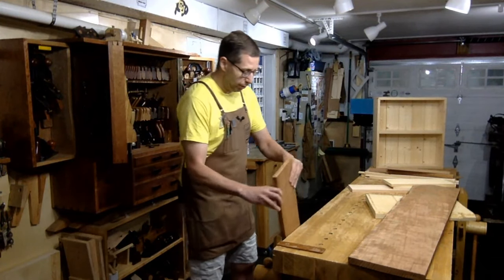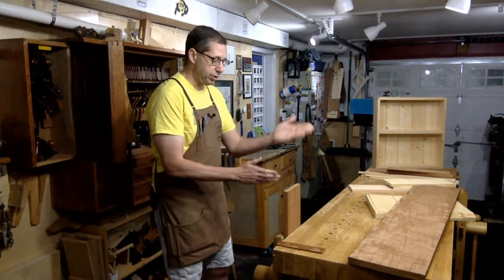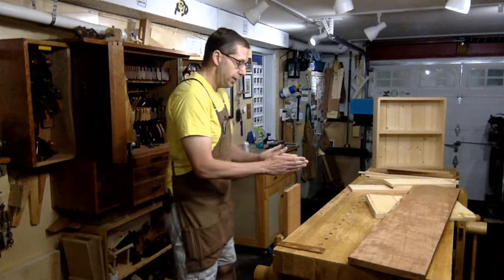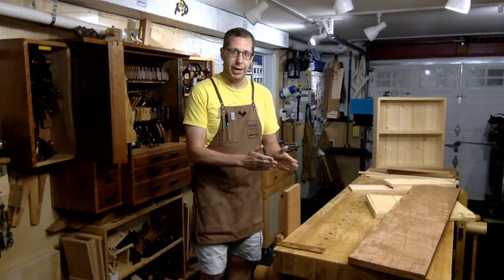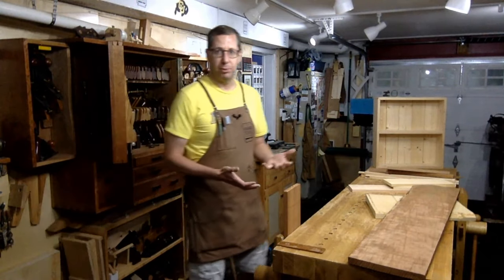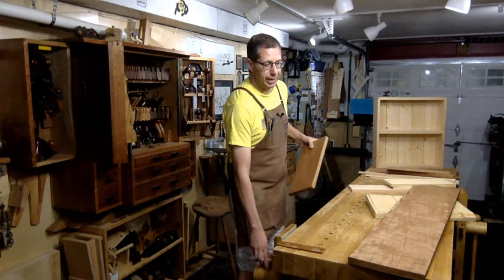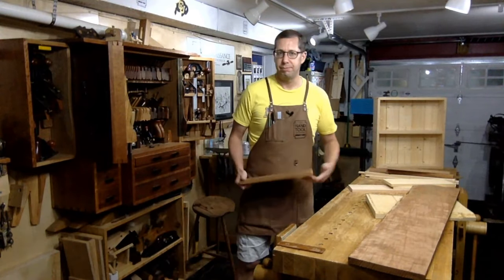And as we know with the pin board, you set that vertical, and now instead of sawing an angle this way, I'm sawing an angle this way, and it's about positioning my body to saw that angle. So whether or not I've nailed that angle on the tailboard doesn't really make much of a difference. So I've just discovered that going through that extra step is superfluous.